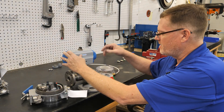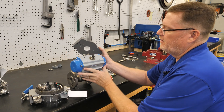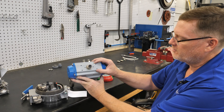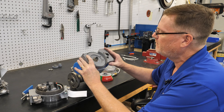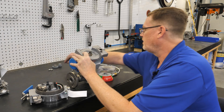The first step is to find the proper mounting kit. Most modern actuators have what they call a Namur mount — the actuators are pre-drilled to accept various manufacturers' mounting kits, and everybody has standardized on the same mounting dimensions.